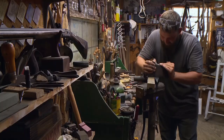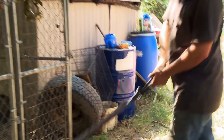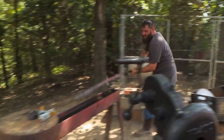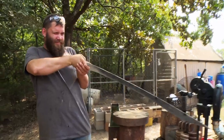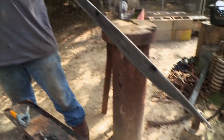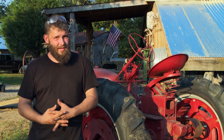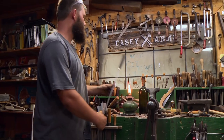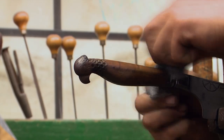No doubt about it. There's still a little bit of polishing I'd like to do before I can call the blade done. My main concern is the actual hardening of the blade. I've been putting it off as long as possible because it could either warp on me or get a crack in it. I'm listening for that ping, trying to make sure it stayed straight. It's definitely not as straight as I was hoping, and there's no way to fix that, so we're going to roll with it. I decided I'm going to do an eagle's head with my handle material — it'll cut a little more weight off the sword. The handle section does seem very small for the size of the sword, but we're trying to stick close to the original. It's definitely a knife handle on a sword, but I put a nice palm swell in there, and I'm confident that will help with the grip.